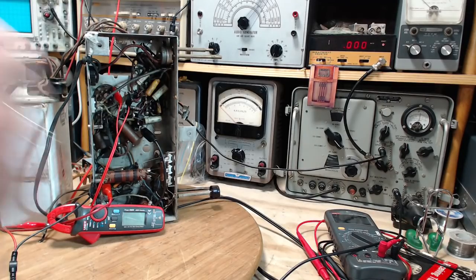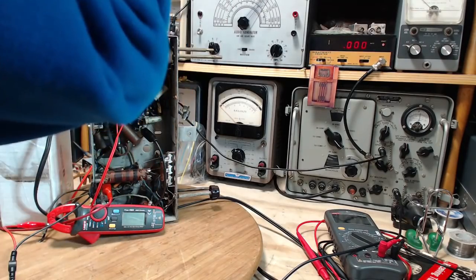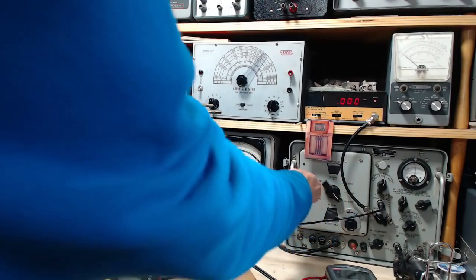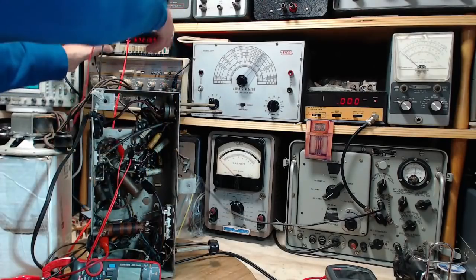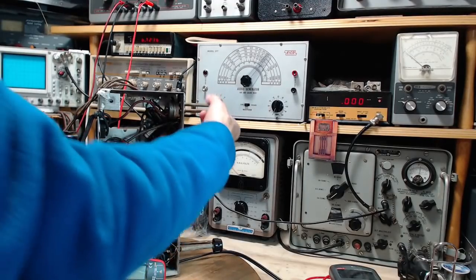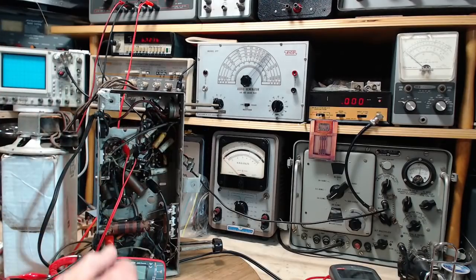The second band is the high shortwave, or the low end of the high shortwave, around 6 megahertz or something like that. Okay, so I'll put this up to 6 megahertz. And this guy here, 6 megahertz will be found around here. We're at 6.7 megahertz now. Volume up. Okay, we can hear a bit of the hiss. I like to have the volume up enough to hear some atmospheric noise or any kind of noise, really.